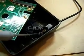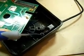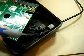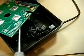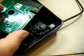I attached a little tie wrap to make a strain relief, so if the cord gets pulled on, it pulls on this and not on the board connector. I will put some hot glue on this as well to hold it in place.